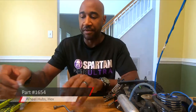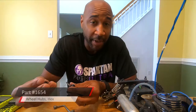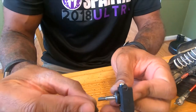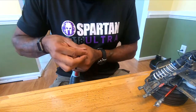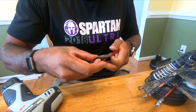The second thing that I ended up drilling out is the hex hubs. I think I have to drill these because they sent me the wrong ones, and I'm probably going to go ahead and order the correct part number again and put it on here. The diameter on here doesn't allow it to seat in by the pin. So because I want to go ahead and complete this today, I'm going to bore this out so that it fits around the axle.